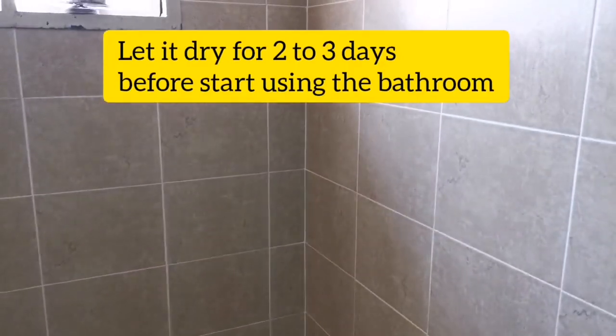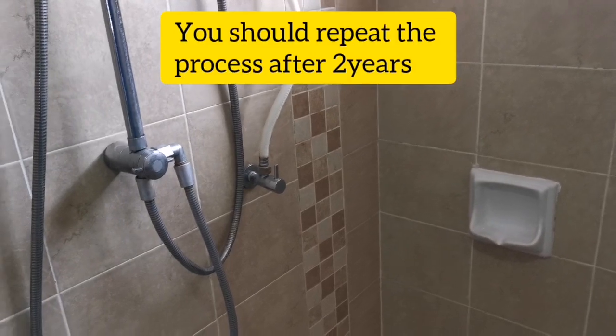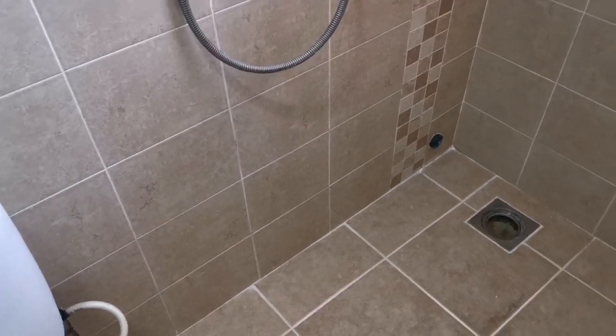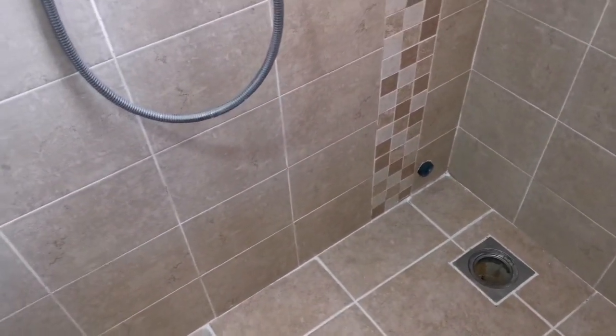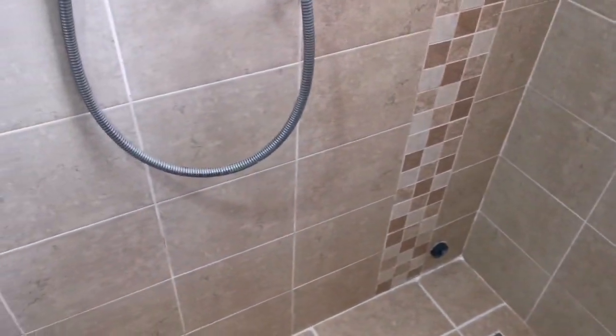Okay. So basically, as I understand, the sealer will wear off as well, so you might need to apply it again over 3 years or 4 years, or even 2 to 3 years if you are hardworking enough. But just make sure you fill up all the small holes with white cement or normal cement first before you start to apply the sealer, and make sure the cement dries for at least 2 to 3 days before applying it. Yeah. Okay, happy trying. Wish you good luck.